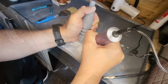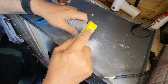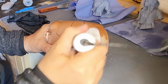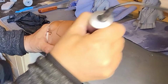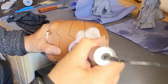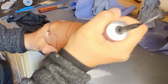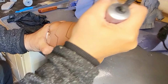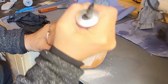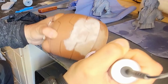Still, obviously it's a 60 grit, I need to bring it down a little bit more, so I'm using that pad with 180 grit sandpaper on there. The thing I did with this little bit here, there were some ridge lines on it, so I've just used a little bit of wood filler purely because I had some lying around. Popped it on, let it set for 24 hours, back out with, you guessed it, the foot sander, and I just smoothed that off, and that got rid of the lines really well. So, I like to use lots of little things, and whatever I've got lying around I use it, and in this case it was that wood filler, and it's done the job remarkably.